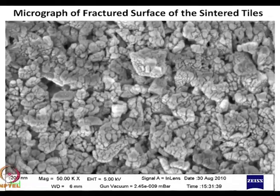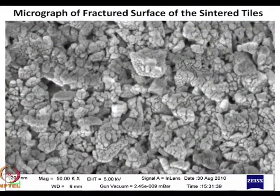This recycling of fly ash into a sintered product, by overcoming the problems of the variable amounts of carbon, was possible because after pressing, operations were done to burn off the carbon carefully. The fact that there was a high amount of titanium dioxide helped in having a very good sintered body.